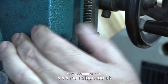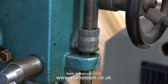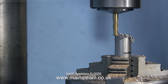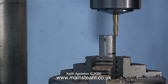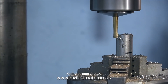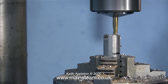The milling machine has a depth stop and I'm setting it so I can cut the slot in the pump ram to the correct depth. Unlike on my drilling machine, the depth stop on the milling machine can be seen in action — it's a very rudimentary device; as I lift it up, when I start to cut the slot it can only go down so far. I'm using WD-40, which I find to be quite a good cutting lubricant, particularly good on metals like aluminium. The cutting sequence begins — I'm taking very fine cuts with a small milling cutter, and if I take too heavy a cut it's just going to go badly wrong. This clip is running at 400%, that's four times normal speed.